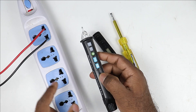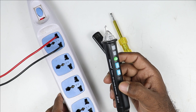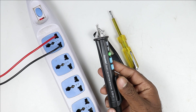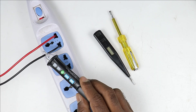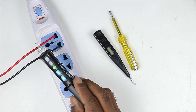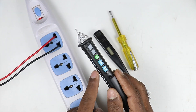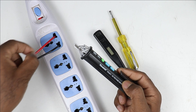But we can use this device even if it is not open. I am turning on the power supply. After turning on, here you can see I connected two wires. If I want to detect among these two wires which one is phase supply without removing insulation, then I can simply use this type of device. If I connect this with the neutral wire — I am assuming the black wire is neutral — when I touch here, there is no indication. It means power supply is not in this wire. If I connect this with the phase supply wire, then you can hear the beep sound. Along with this, one indication is also glowing. So when using this detector, if beep sound comes and the warning indication is glowing, then you can say that current is flowing in your wire.